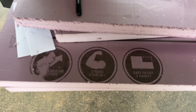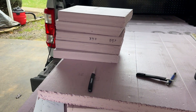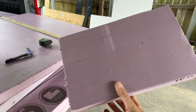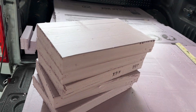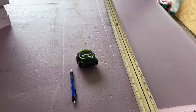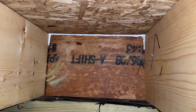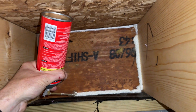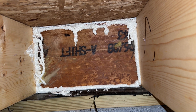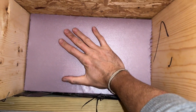Next we're going to focus on getting all of our rim joist bays insulated. I've got two-inch-thick R10 rigid foam board picked up from Home Depot — not super cheap, but easy to work with. I've already cut some pieces into rectangles for each bay. All you really need is a retractable knife extended to cut through the two-inch thickness, a pen, a tape measure, and a straight edge for your cut lines. I used Great Stuff basic foam in a can to seal them up — it acts as an air sealer and a glue for each panel. Slip them up into place and give a firm push to seat them all the way back against the rim joist.